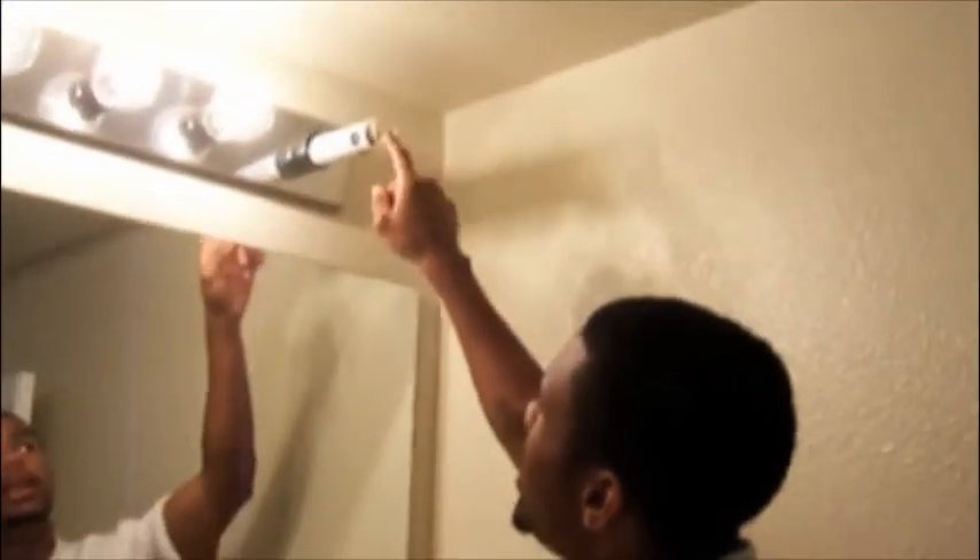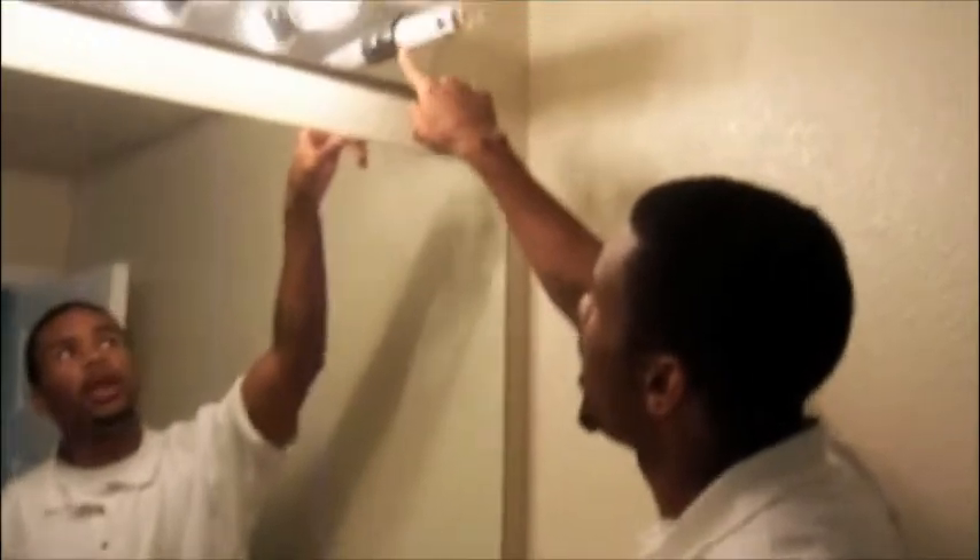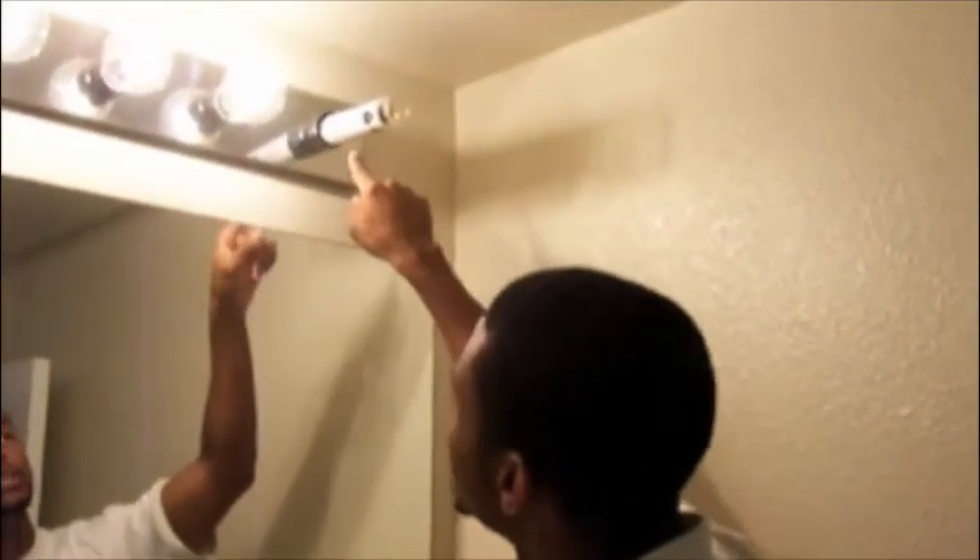I'll distribute the power on now. As you can see, the first indicator shows that if the lamp blinks, it indicates the lamp is actually okay. If the lamp does not blink, then you'll want to check your starter. But in this particular situation, the starter is perfectly fine.